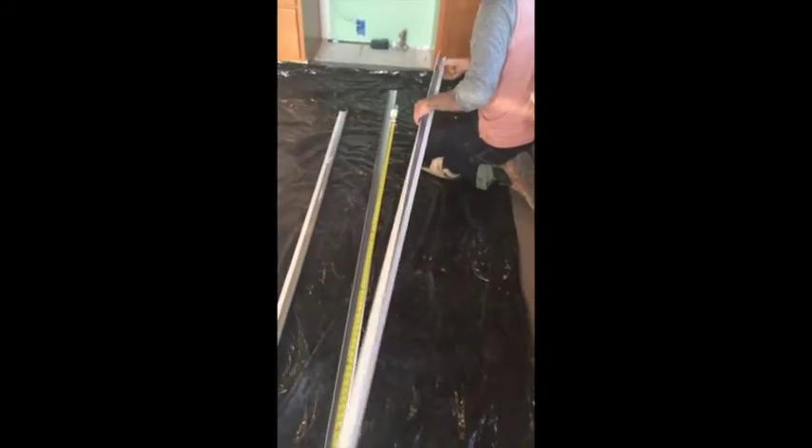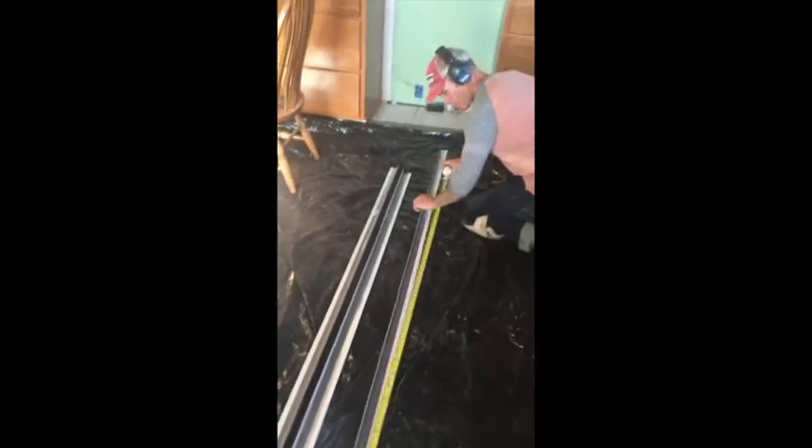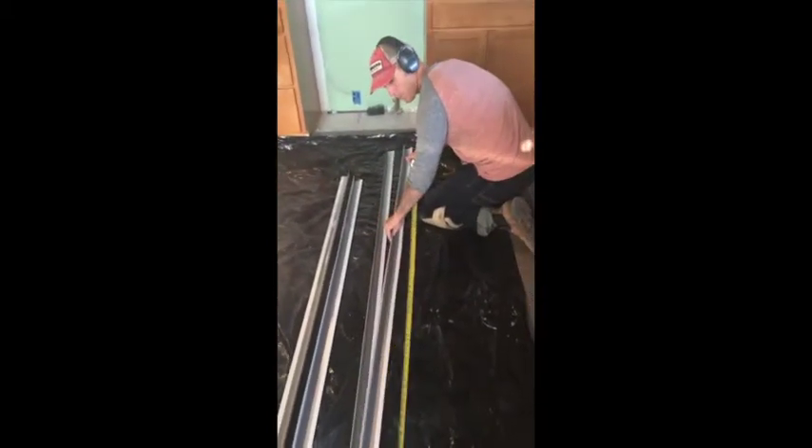Now that we've got all the clips out and the thinset scraped out of the seams, this tile is ready to be grouted and sealed. What you've got going here is the drywall corners that get mudded in place to each corner — that helps give reinforcement so that when you bang up against a drywall corner it doesn't completely fall apart. And over here I'm extending the electrical switch that used to be in the hallway — the switch to that fan light — extending it in the junction box and putting it over in the dining room area.